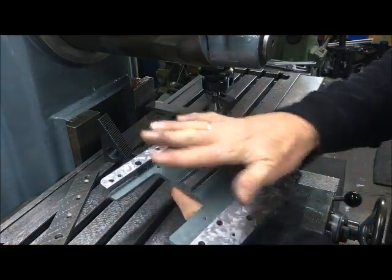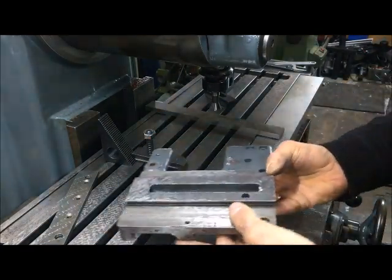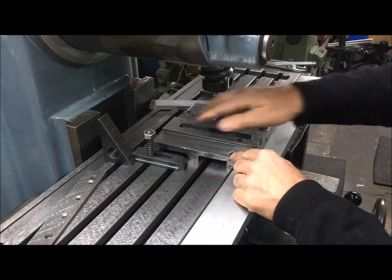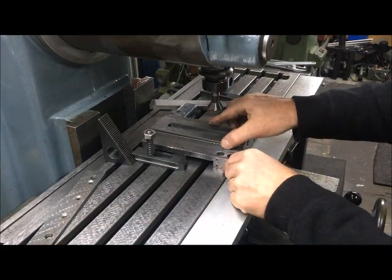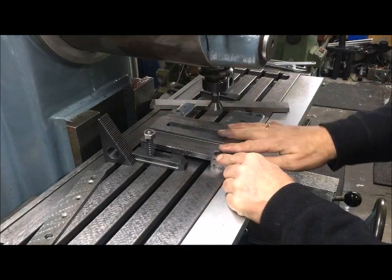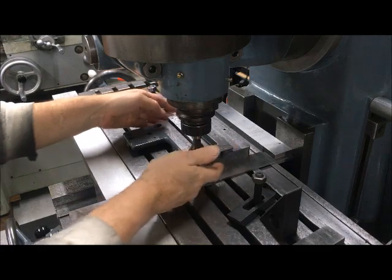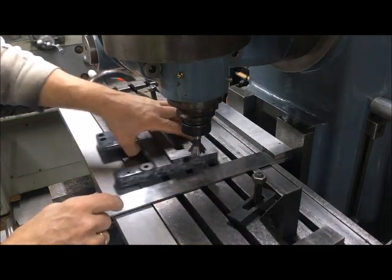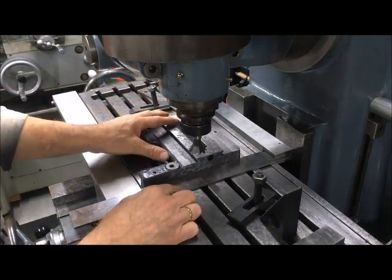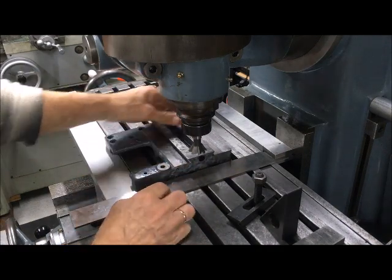I just scraped it so it should have a better contact area, but these are flat. These are just areas not in use for anything but static fit — to the apron and the rear hold-down. So I know that these are flat, then I can use this to mill and be certain that these are flat. Now that I know these are parallel to the unworn way, I can use them for guidance. I scrape and verify them, so I just do it.